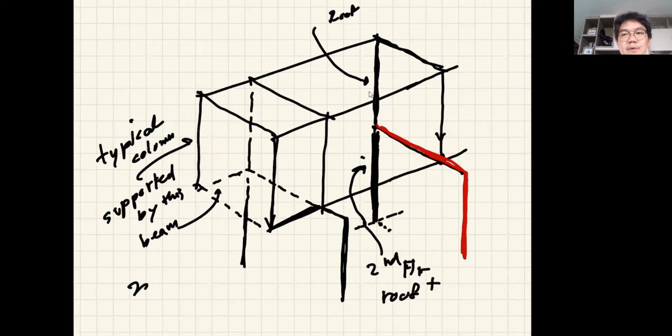Well, that depends on how you are going to construct the first floor, because sometimes they would use the structure called the slab on ground or ground slab. Whenever you see that, it means the slab sits on the ground because they don't want to put the load of the ground floor onto the foundation, to reduce the cost of the piling system and so on. I'm talking about the ground floor. It doesn't have anything to do with us, but I think you guys should know.